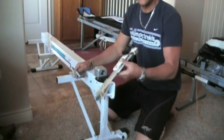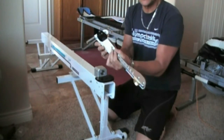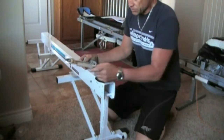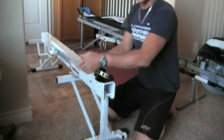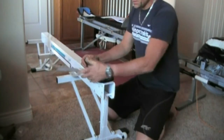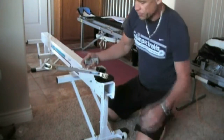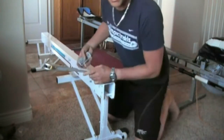Steps 6 and 7: you simply attach these two pieces together. I wouldn't snug them down too tight — you might have to adjust it in or out. This goes in the front side, it slides in. This one is going to take your paddle and set the position from right to left. It's going to slide in there, and then you'll see the bolts for step 7 which will attach it to that bearing.